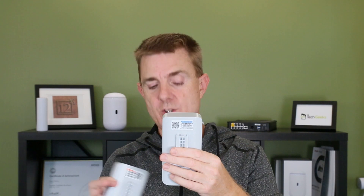There is one unit called the recorder end and one called the camera end, because these are often used as a wireless bridge out to surveillance cameras. It doesn't really matter which way around you have them. You'd plug the recorder end into a switch or PoE injector with an internet connection, power it up, scan the QR code, then repeat on the other end — and those two are up, running, paired, and ready to go. Then you can go mount them on the building. These are good for up to about 500 meters, where you'd get around 90 megabits per second.